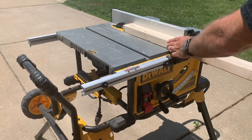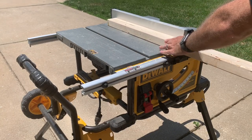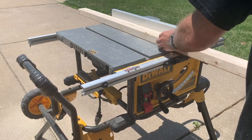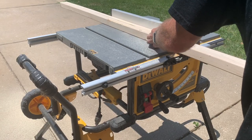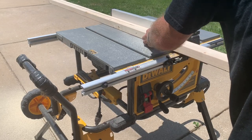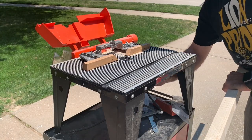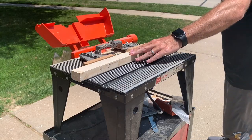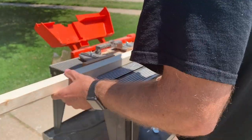After that, it was time for the cleat on the inside of the frame — this is where the 2x3 came into play. The piece I cut ended up being a little bit more than an inch and a quarter. After I made the cut, I ran the other piece through as well to make sure they were the same for each side. Then after I ran these through the table saw, I also routed them just to soften that edge. Nobody would be touching this — I was just trying to reduce chip-out as we were working with it. So I ran all these square corners through the router table again.